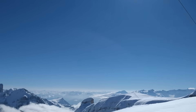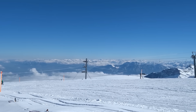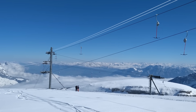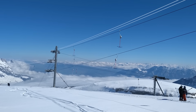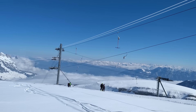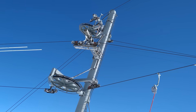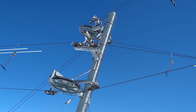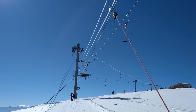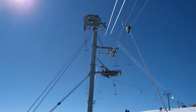This is a ski lift located at Khasa Ruk. It has a more pronounced curve, thus the t-bars coming back down would have to follow an outwards curve that is too pronounced. To avoid this, the builders decided to let the descending t-bars take two sharp inward turns instead. Go ahead and observe a t-bar as it moves down from the top right corner of the video. After the first turn on the topmost wheel, the t-bars are aligned with the lower part of the ski lift. But since the turn was inward, they are now moving up and need to take another 180-degree turn in order to proceed in the correct direction. The resulting construct seems to be coming from an animated sci-fi movie and offers a delightful view to every engineer. However, this solution can only handle right turns and the t-bars must be raised several meters above ground, limiting it to the descending lane. It would not be possible to apply this principle to the t-bars carrying people.